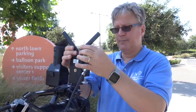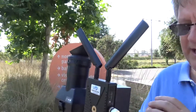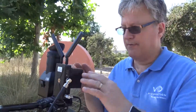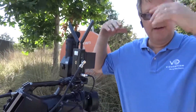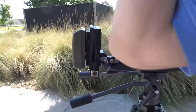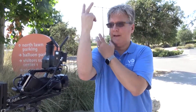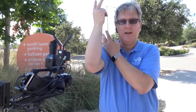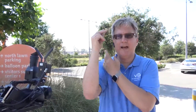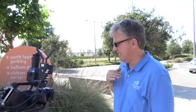We have two 60B antennas on top of the rig. As you'll see in our tests, you get better performance when the transmitter is above your head, above the crowd. This is a shoulder mount setup — I'm going to put the unit up on my shoulder so the ducktail antennas are above my head. As I'm spinning around, I always have clear line of sight to the receiver to maintain a good video signal.